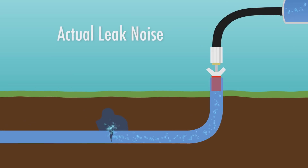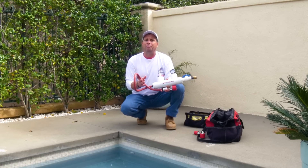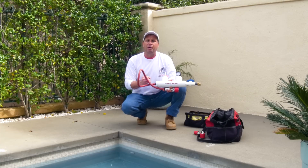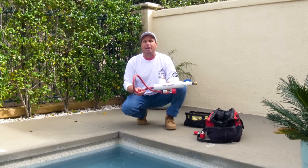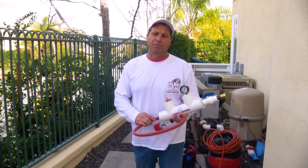What that does is it creates a very distinct boil. On PVC pipe or plastic pipes, you're never just going to hear air, and you're never just going to hear water. You're always going to hear the combination, which will sound like a boil — which we're going to demonstrate right now. We're going to be testing this two inch line that's behind me with the pressure rig.